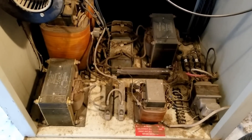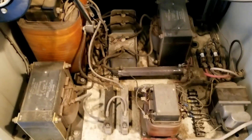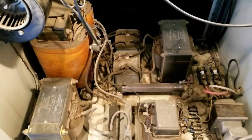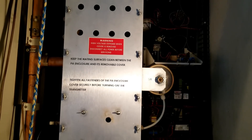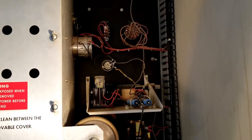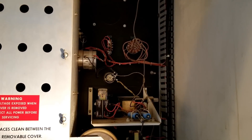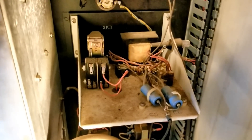We're currently up here trying to diagnose a power supply fault. Down here on the floor of the transmitter is the high-voltage section, which creates 3,000 volts up to 1 amp. This is the back of the MX-15 exciter. Up here is the tube compartment where the 4CX-1000 sits. Over here on the side is some over-current relays and some time-delay circuitry. That's actually the bias supply shelf — the bias power supply, which creates negative 25 to negative 40 volts.